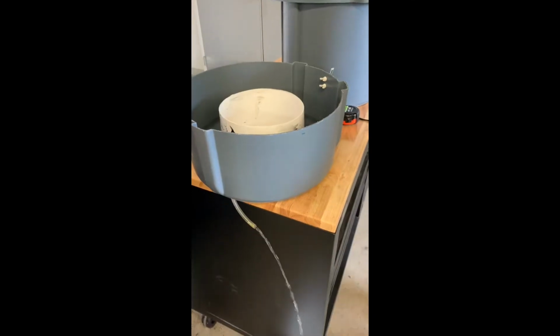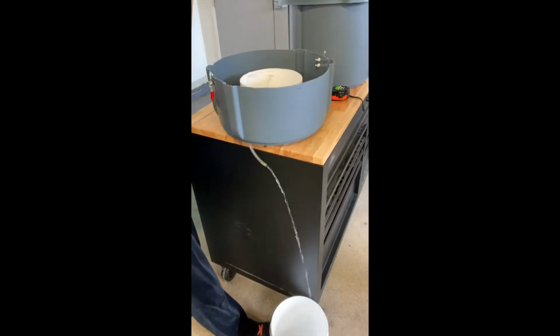The design for our water tank allows 6 gallons of water to be held in it. And so our drip emitter drips about 1/2 gallon of water into our siphon tank every hour. And then we built our siphon at the specific height so that when 1/2 gallon of water is dripped into it, it will create the siphoning effect and release that amount of water from the system. And so because we have 6 gallons of water starting in our system, and 1/2 gallon of water every hour is being dripped into our siphon tank using the drip emitters, and then our siphon is releasing that 1/2 gallon from our system every hour, our solar tracker will run for approximately 12 hours throughout the day.